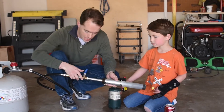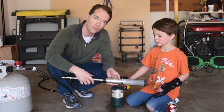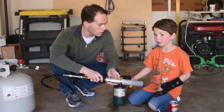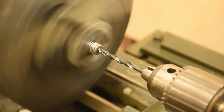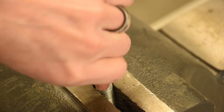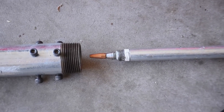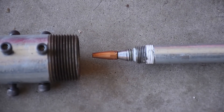As you can see here, I did away with the traditional 3/8 end cap because it restricted the airflow too much past the burner. The old burner worked, but this burner is a lot better as you'll soon see. I cut the head off the bolt, then tapered it and drilled through, and I actually ended up tapping the inside and installing this MIG tip. Because if you tried to drill a tiny hole in steel, you know it's really hard to do without breaking your bits. So what I did was I simply tapped the inside of this bolt and then threaded this 0.030 MIG tip on, and it seems to work just fine.